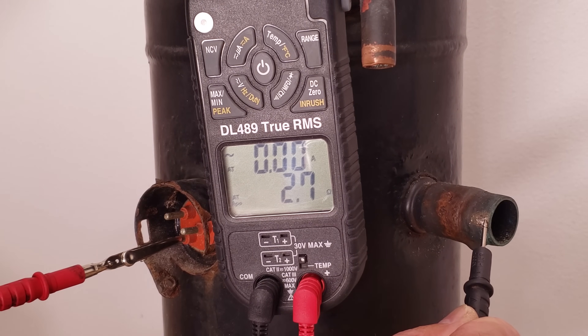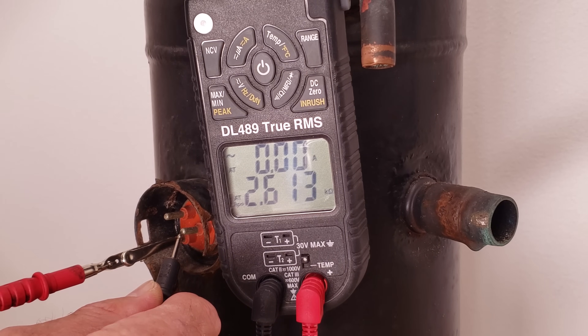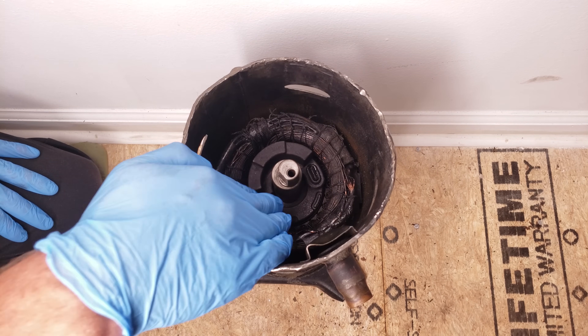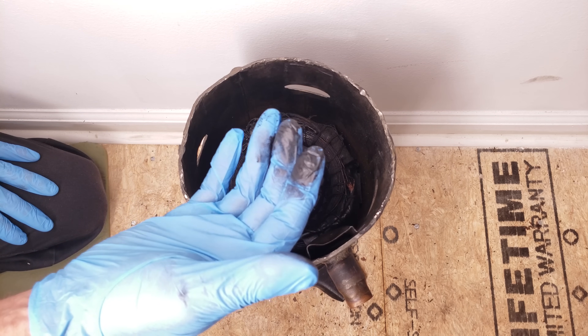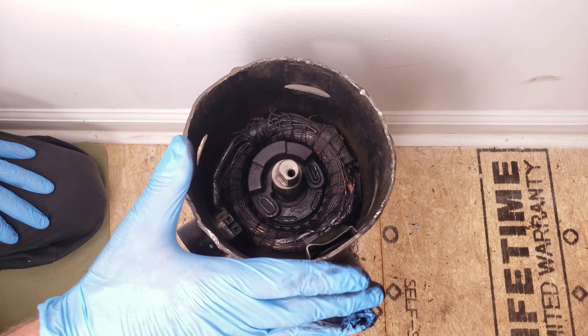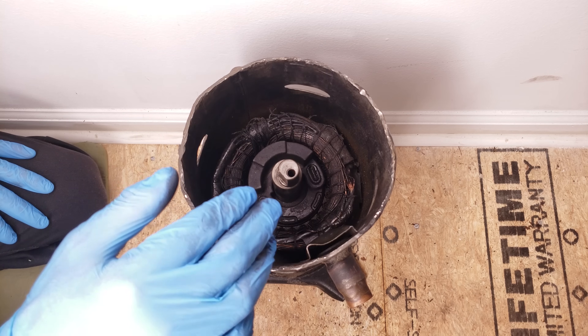This scroll compressor is shorted to ground — we're reading 2.7 ohms of resistance from the winding over to our tube. When checking the pairs on this particular compressor, we're reading over 2.6 kilo-ohms — that's a big problem. This compressor is going to burn out and create acidity within the system. Here's what the inside of a burnout compressor looks like — we removed the scrolls and you can see all the black soot on the inside. That soot is throughout the line set and the evaporator and condenser coils, because refrigerant moves through the whole system when a compressor burns out. If you replace the whole outdoor unit, you'll still have contamination in the line set and evaporator coil.